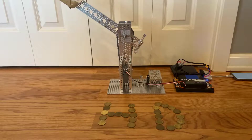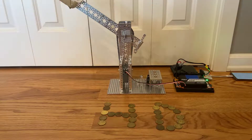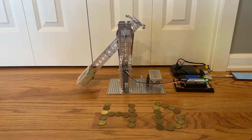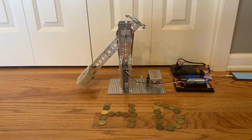Also, the fact that the servo indirectly moves the load means that it is much harder to break the servo. We decided to use a chain rather than a belt here because you can change the length of a chain, and they also don't slip compared to belts. However, assembling a chain is very annoying compared to a belt, which you might want to keep in mind while you are building your own arm.